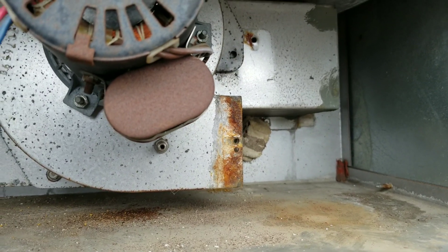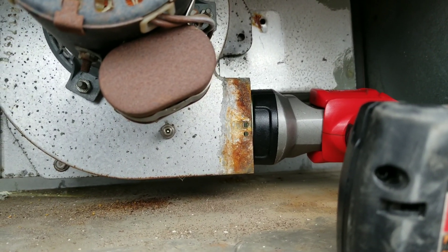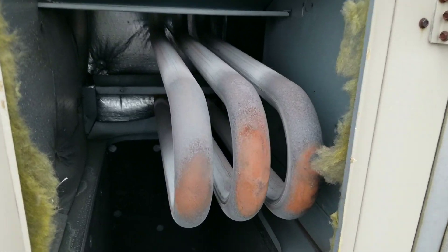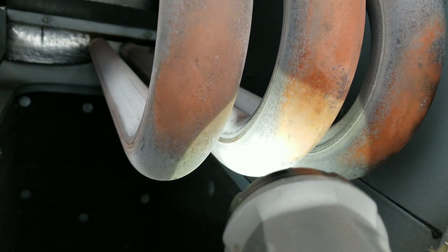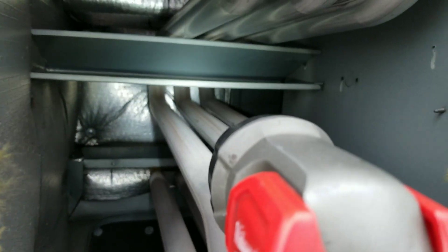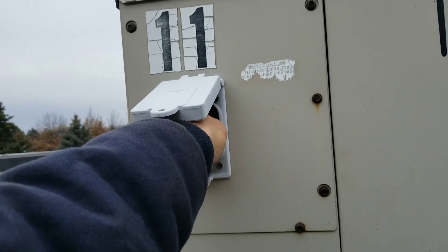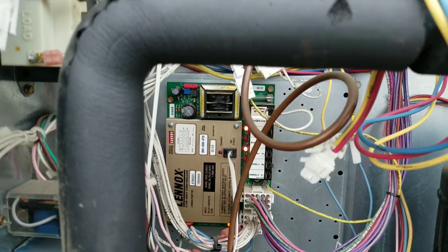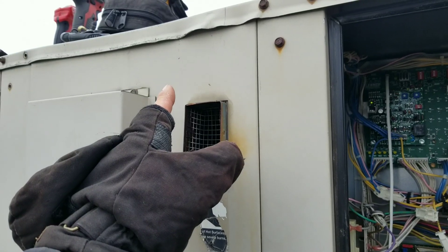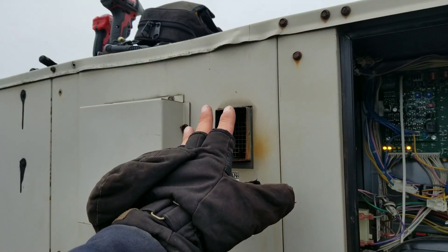Just to be sure, let's see if we can see some light through there — there you have it, you can see right down into that port now. Real quick before we fire it up, let's check this heat exchanger. There's a spot that's getting kind of bad, but there's no actual openings on any of these seams, so we should be good — probably get another season out of this heat exchanger. She's gone for heat and we have ignition. Awesome — zero fault codes. I think we fixed her, guys.